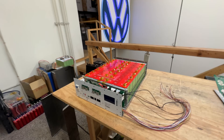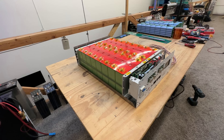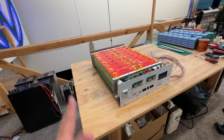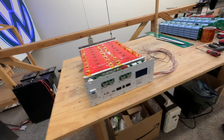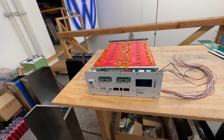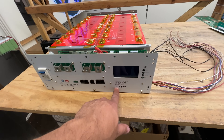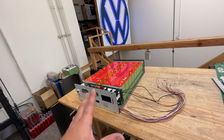All right, time for a battery update. This is going to be a rack mount but also a wall mount enclosure for the 16s, 48-volt LEV 60 cells — lithium iron phosphate. It will be a little bit smaller than your typical five kilowatt hour rack mount units, because those are usually 100 amp hours. This one at 74Ah would only yield about 3,788 watt hours.